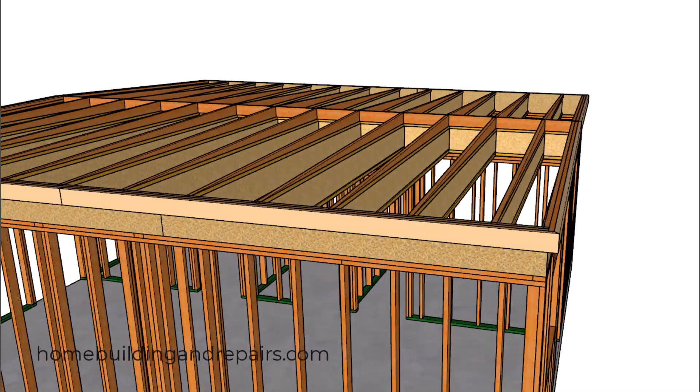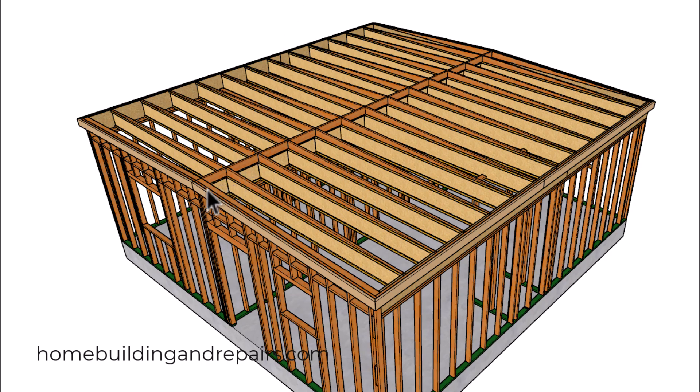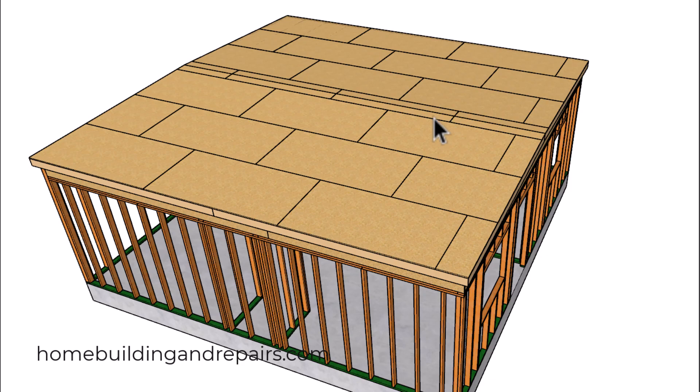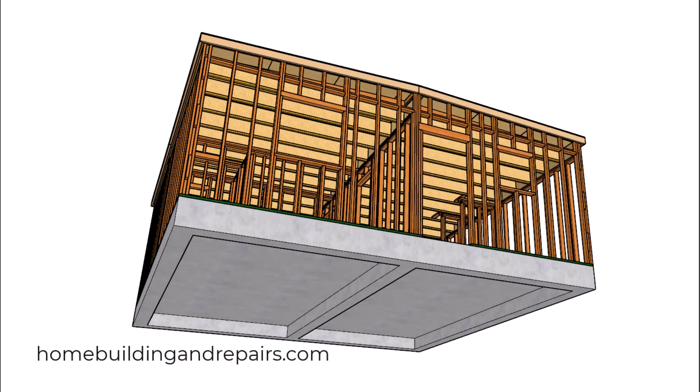Let's pan out — it's not a bad looking building. Looking at how everything finishes out for roof sheathing installation, even though I installed some smaller strips here, you might need to install wider ones. Some engineers require minimum roof sheathing sizes of anywhere between 16 and 24 inches, meaning smaller strips might not be approved. Also don't forget that you might need a center load support footing, depending on whether the joist can span the full width or length of the building.